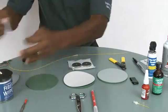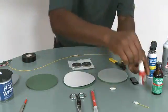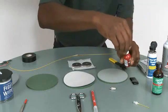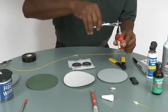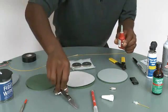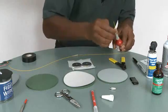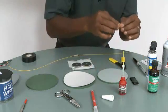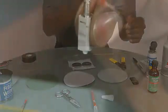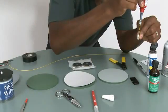After the boot is installed, clean the tip of the connector, and then prepare the adhesive. If you have a new bottle, snip off the top, then install a syringe tip and make sure it's firmly seated. We're going to start by injecting the adhesive inside the connector body, and look for a bead to form on the bottom of the connector, indicating that the adhesive is all the way through the ferrule.